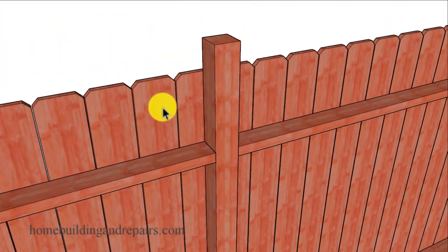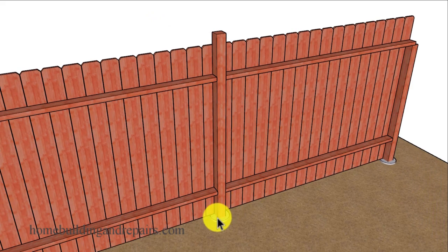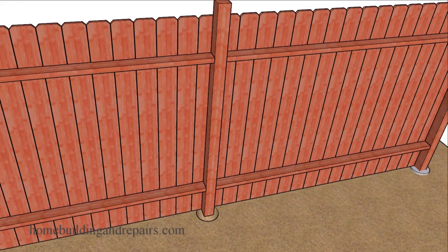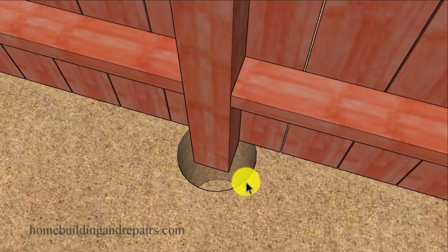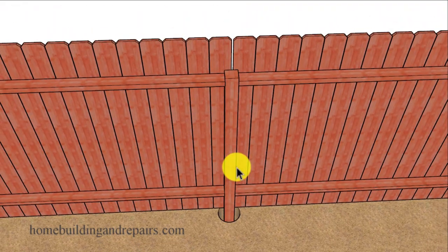You would be able to use it if you allowed the fence post to extend beyond the top of the railing. The reason why you might choose to do this is because when the fence post rots at the bottom, you can simply remove the concrete footing and then cut the bottom of the fence post — and you don't need to do it while it's attached to the fence. Otherwise you won't be able to lower it into the hole so that you can reuse the old fence post.